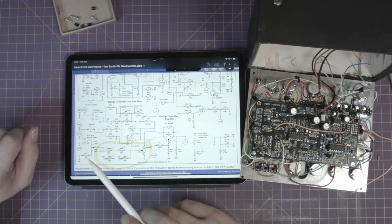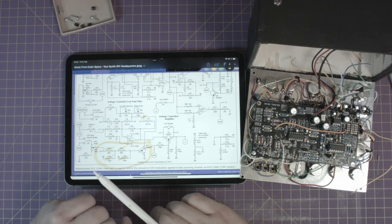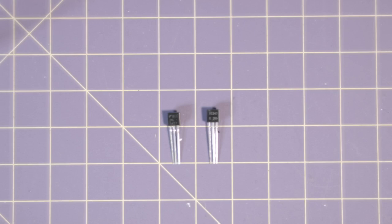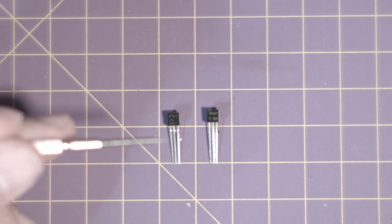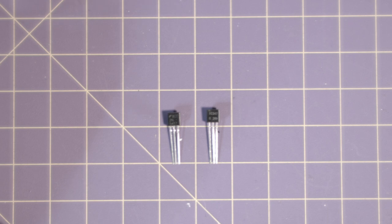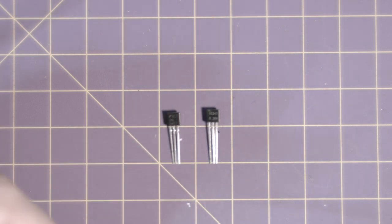These 4 resistors, R39, 40, 44, and 45, bias our input to the gate of our transistor and modulate it within the transistor's resistive range. I've noticed over the years when following and adapting Ray's designs that sometimes newer models of the same transistor will have a slightly different resistive range. What I mean by this is that a transistor will function as a voltage controllable resistor only for a small range of voltages applied to the gate. If you exceed this voltage, the transistor simply acts like an on and off switch instead of gradually increasing and decreasing resistance.